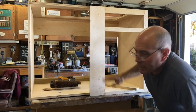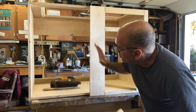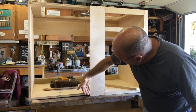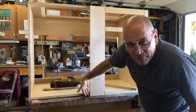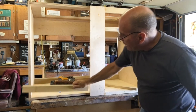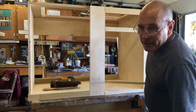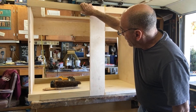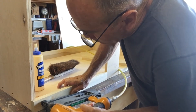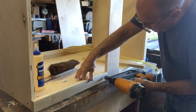You can see right here there's a big open space where the other cabinet is going to go in, so we don't really need anything there. But we do have a gap here where things can fall down. So top and bottom, I've cut a rail that's going to go there — nailed and glued in place — to fill in that gap. And if I need to, I can also use that to attach it to the other cabinet.